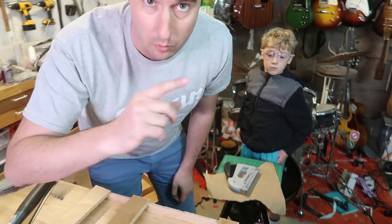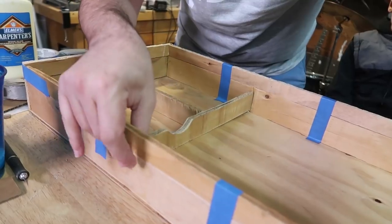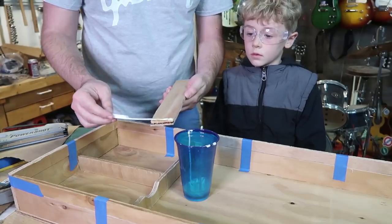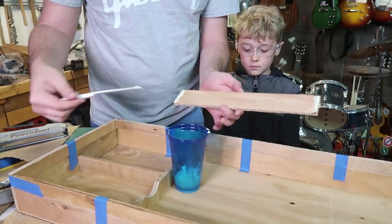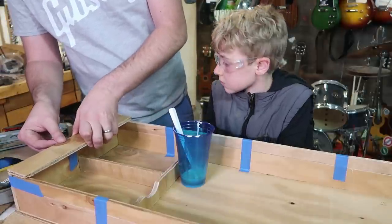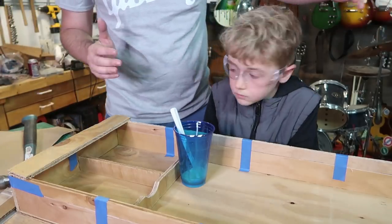We're going to cut a couple more slats and then we'll be back. Since the lid is made of such slim pieces of wood they kind of bend and warp a little bit, so I taped them to the actual box just to give it its shape. The lid is actually taped to the box. Now we're going to put other pieces of wood across which should make it even stronger, so we're going to put glue on the edges and that'll kind of hold this all in place while you're hammering the other pieces in.